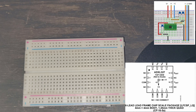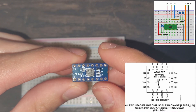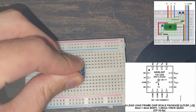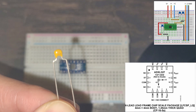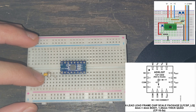Now officially starting the breadboard, we're going to grab the heart of our breadboard, which is the accelerometer itself — the ADXL327. It has the actual chip name right here and it's going to have pins 1 and 16. For our application, we are going to have pin 1 facing down, and we're just going to plug it in across the bridge of our breadboard, right in the middle, and push it firmly until it gets stuck. Once it's in, we're going to deal with the power. We're going to be using a 0.1 microfarad capacitor — mine says BC 104 on it and it looks like a little spider — so we'll put this somewhere over here.